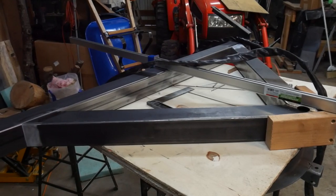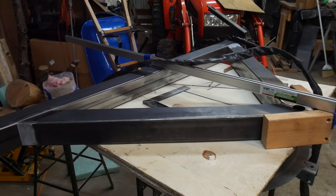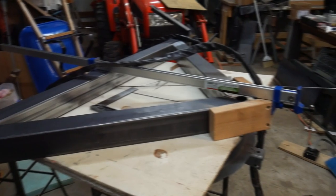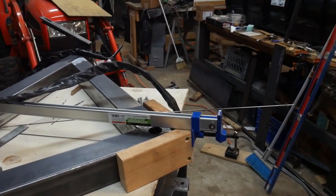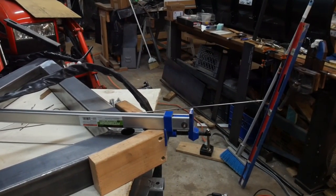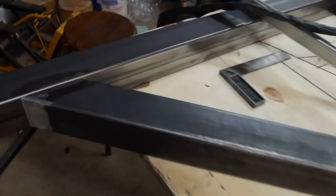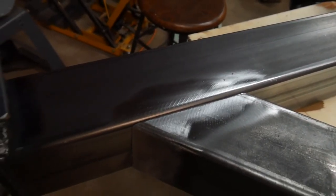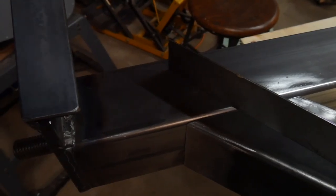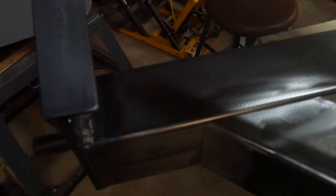I've got the triangular front piece ready to weld. See how I clamped them together – I used a little block at the top with an angle cut on it so that I've got a good face on it, pulling the two sides together. Where they're going to join has to be very clean, so you want to clean it. And always be sure your surface is nice and flat – I actually had to shim up on one side, and on the other it's perfectly flat.